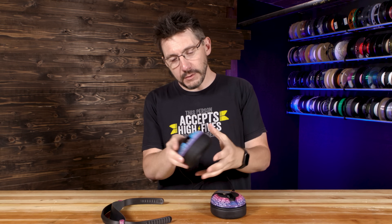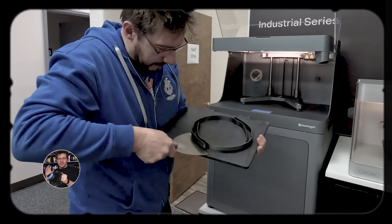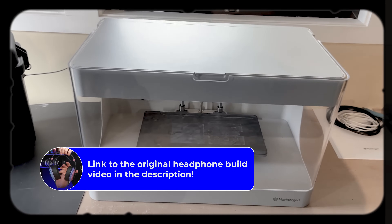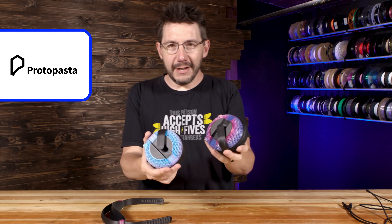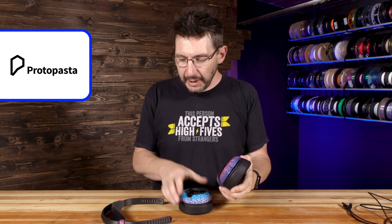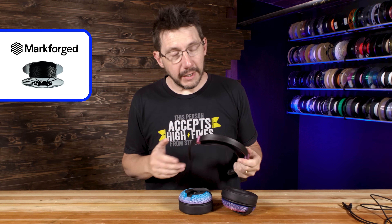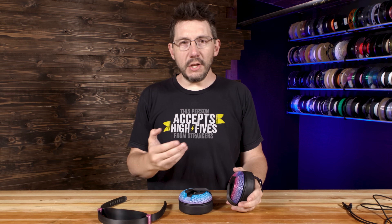Originally, my Hedamame headphones were printed with parts from the Markforged Mark II 3D printer, and I used Onyx in order to print these parts. I used Proto-Pasta on the colorful bits, but the black bits were Markforged Mark II in their Onyx material. Onyx is a nylon base, but on the Markforged it has continuous carbon fiber. Typically these parts are printed with a more rigid material, such as PLA.